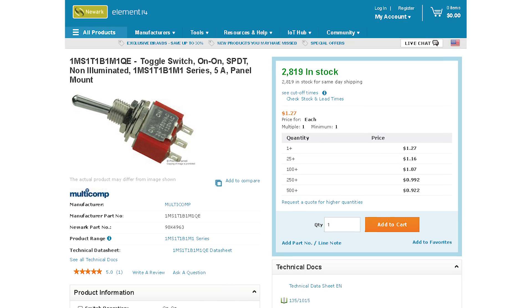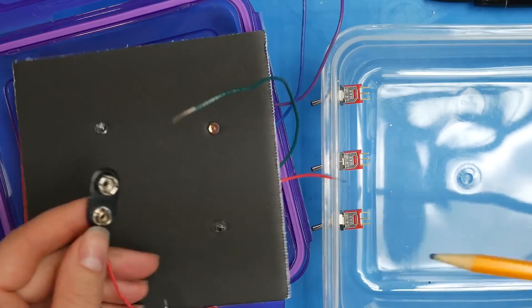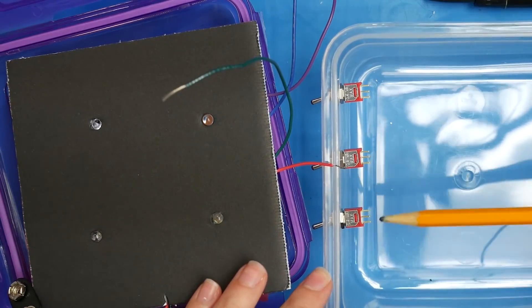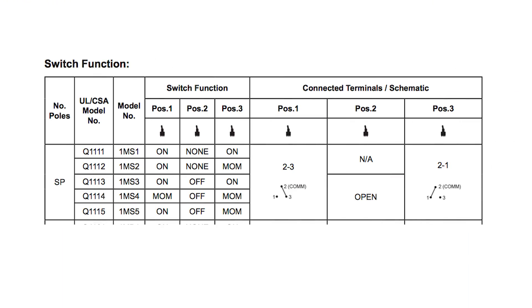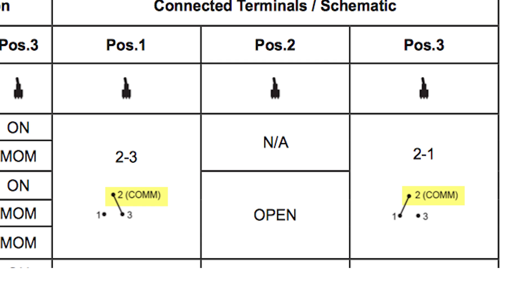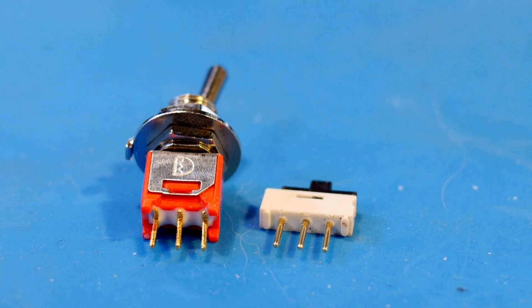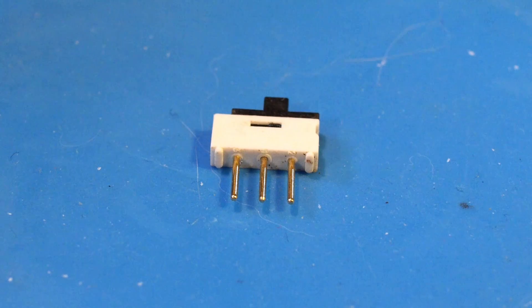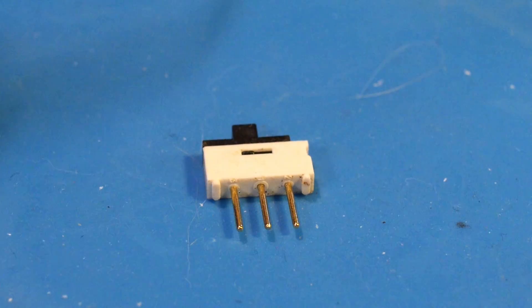Let's look at some smaller switches to cover the wiring for use in projects. Here are some single-pole double-throw, or SPDT, toggle switches. They look similar to the toggles used in the Skylight Logic project when we learned about diodes. While those were all single-pole double-throw switches, they were on-off-on switches with three positions — for this example, we want on-on switches like these. Here are our three contacts. Looking at the datasheet, we find the pinout, and pin 2 is the COM pin, leaving pin 1 and 3 as the traveler contacts. With switches like these, whichever way the toggle or slider is pushed, the two pins on the opposite side become connected.